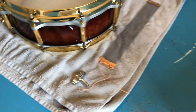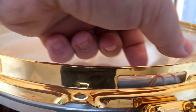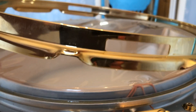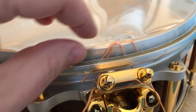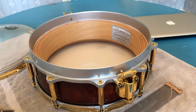Here's a better look at the situation. The cables are supposed to come through here and come right through this little slot right there where my finger is. However, if you take a look here, the cables accidentally got wrapped under the head. When I tension this bottom head — which I tension very high — the pressure on the cables right here, when I press it down, puts pressure on the cables. Too much pressure just made them snap off.